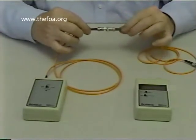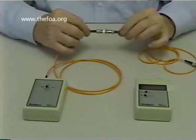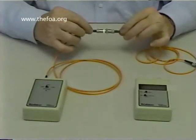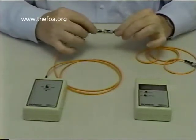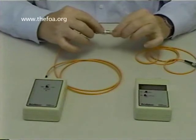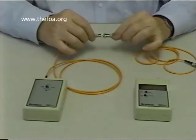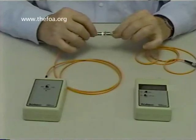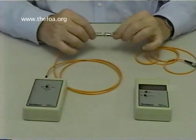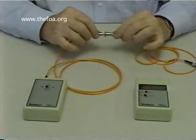Now I have two connectors mated together and I have loss. There is no loss to a single connector in fiber optics — loss is always specified as the loss of a mated pair of connectors. The loss in this mated pair is determined by how good the connector is on the end of my reference cable, how good the connector is on the cable we want to test, and how good the mating adapter is. You cannot ignore mating adapters in loss. There are mating adapters available in the marketplace that have plastic alignment sleeves — please don't use these for testing. They're good for about 10 insertions, then the ceramic ferrule shaves off the plastic and creates a good attenuator.